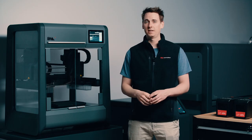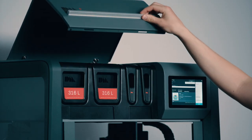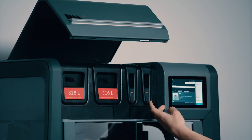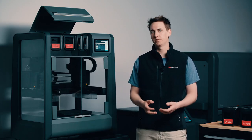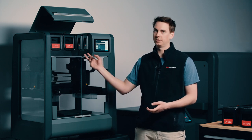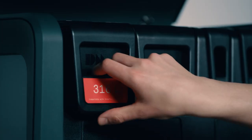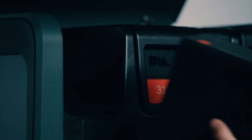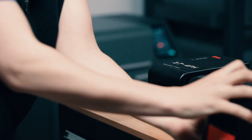Now that we know what's inside each of these cartridges, let's go ahead and swap them out. The Studio System is designed to make this process super simple — the cartridges live right up here on top of the printer. We have two cartridges on the left side to hold the metal rods and two on the right side to hold the ceramic rods, which are used for the interface layers. Since the ceramic material is the same for 17.4 and 316L, I don't need to swap those. I just need to swap out our 316L cartridges by pressing inward to release them, then sliding them out and replacing them with the 17.4 pH cartridges.